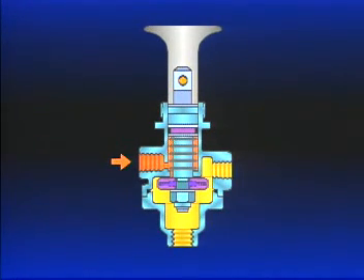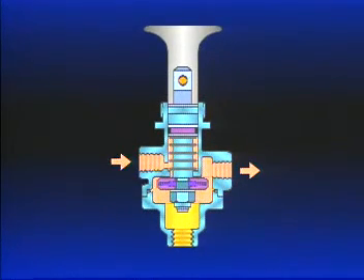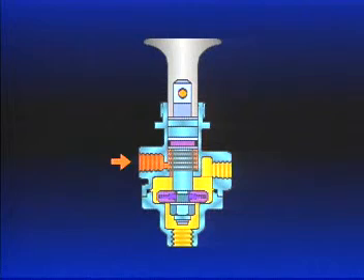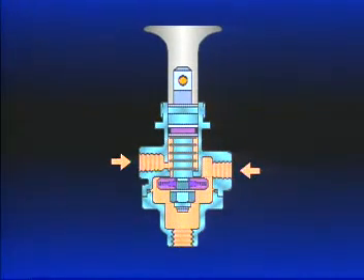The PP1 is manually applied. If supplied pressure decreases to a specified minimum setting, usually 40 psi, the PP1 will automatically move to the exhaust position. The plunger pops out, releasing air through the exhaust port. Pushing the plunger back in to the applied position reactivates the control, but supply air pressure must be above 40 psi for it to stay in.